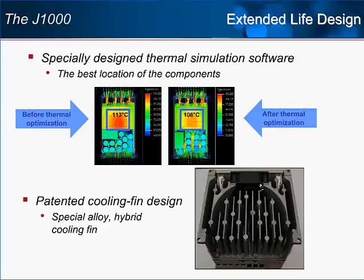The next step in reducing the heat within the drive is to make the heatsink cooling more efficient. Yaskawa drives utilize a heatsink design that promotes air turbulence while the air flows over the heatsink. The turbulence allows the cooling air to spend more time in contact with the fins. This keeps the drive cooler. The design also incorporates features that promote the chimney effect, which has been proven to increase convectional cooling for electronics.